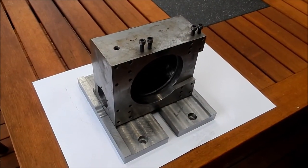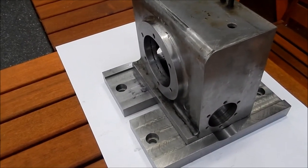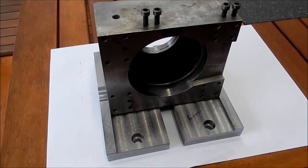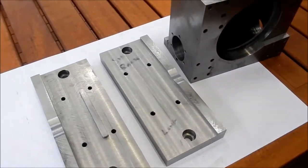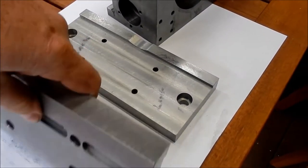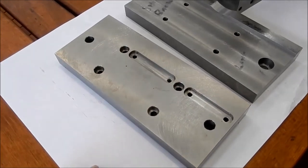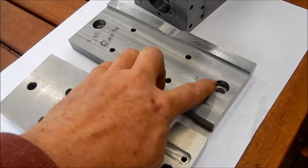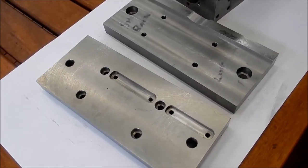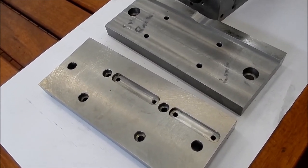That's our feet finished. I've just got to do the keyways off camera — just cut a length radius in the ends and then drilling and counterboring, no great rocket science in that. The housing mounts up beautifully to it. I've got that keyway sitting in there and that's the rear end showing our locating keys against the saddle. These are the facets that go back up into the housing and these are the facets we're going to be using to bolt it down to the top of the saddle. I've got to drill another two holes to get one of the mounting sets in place, which is no drama. That will also allow me to strip it down and measure up that feed screw for the saddle so I can draw it up and make a new one.